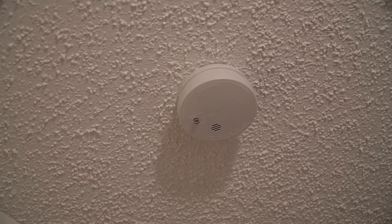Another very important safety feature for the home is having both smoke alarms and carbon monoxide alarms. Every bedroom should have a smoke alarm, and carbon monoxide alarms should be located within 15 feet of any sleeping area. Some are hardwired into the home with battery backup; many are just battery-powered and screwed to the ceiling. These batteries should be tested once a year by pushing and holding the button — if it beeps, the battery is still good; if it doesn't, the battery needs to be replaced. A beep every one or two minutes indicates the battery or sensor may be bad and the whole unit needs to be replaced. They can be purchased at any home center for fairly inexpensive costs.